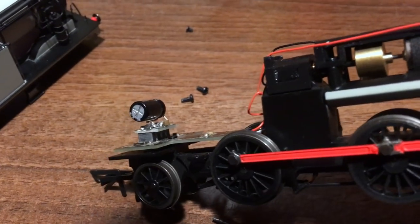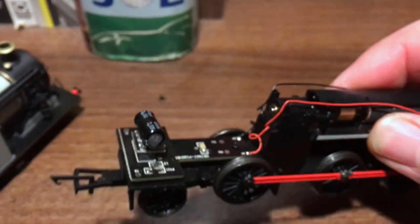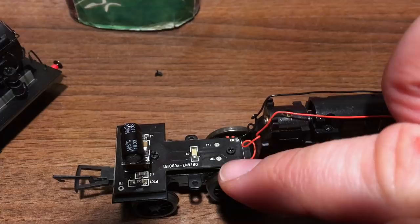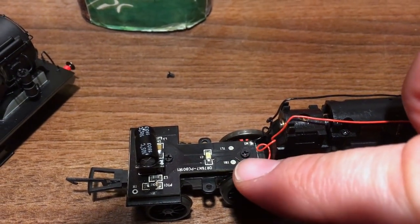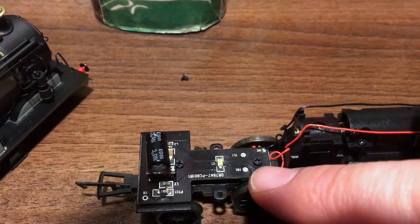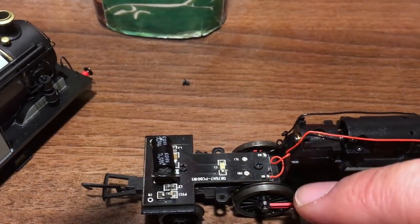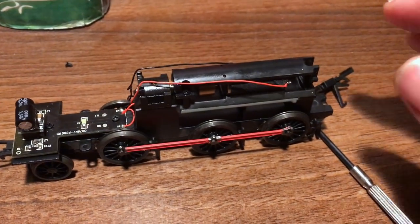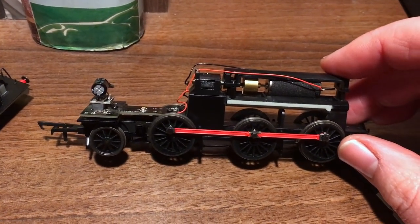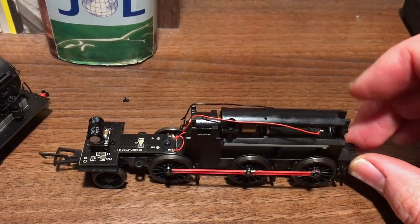I've also straightened up the capacitor - it had a wire underneath and I was worried that might have been touching something. The particular area I wondered about is two plungers underneath that come up from the pickups - I wondered whether one of them was stuck down slightly, so I've cleaned them. It does seem to be a very strange method of attachment that's a little bit prone to something going wrong. Having had a fiddle it may actually be one of those annoying faults that just goes away after you've prodded everything - you never quite know what you did, but it appears to have fixed it.